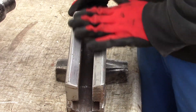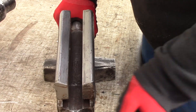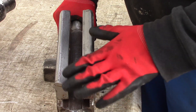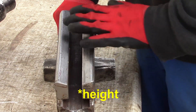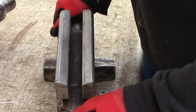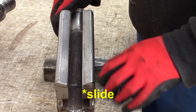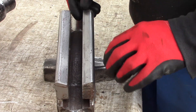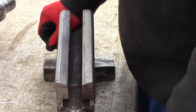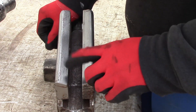So let me take this apart and show you how I did it and what to look out for. This is the welded-up slide - it's not 100% perfect but it's good enough. I basically welded it up quite a bit because it was really worn down, then filed it down to the proper length. You will have to keep the angle correct. You can also just put a shim on the dynamic jaw - then you don't have the problems with keeping the proper angle. I welded this up and it was quite an ordeal because I made some mistakes and had to do it twice.